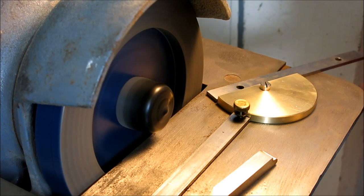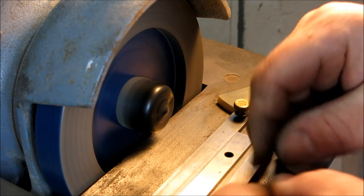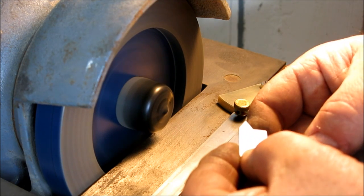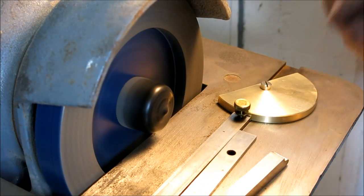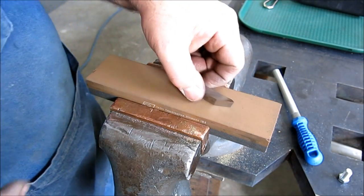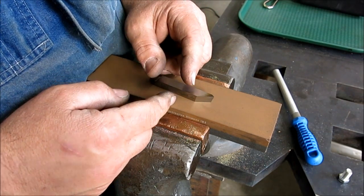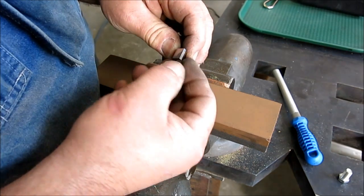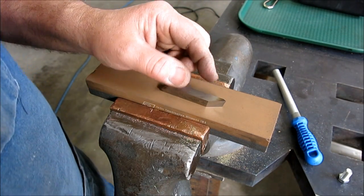Actually, what did I do? Oh, there it is. This is what we call PFG, and I'll let you guys guess what that means. Okay, so the Whitworth form has a radius, a nose radius. But it's actually very, very tiny, especially with this particular pitch of thread. So really just a breaking of that edge is more realistic. I think it's a 5/1000ths of an inch radius.